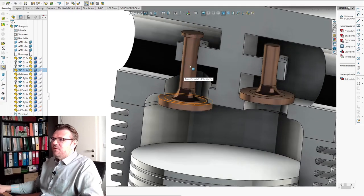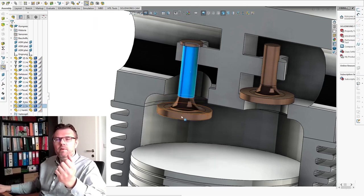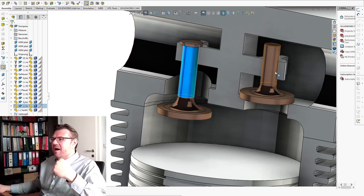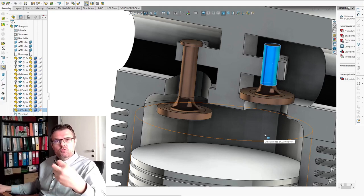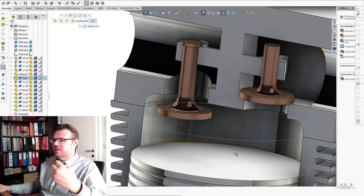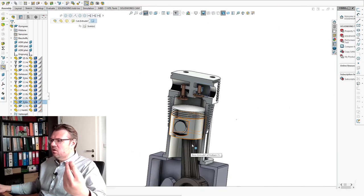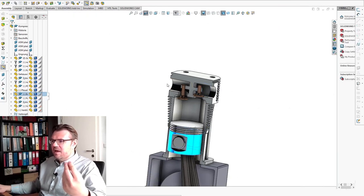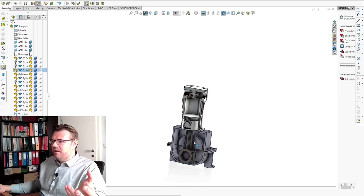this valve, there is usually also a spring, spring loaded, so this valve will open. And this valve here will automatically close, because the pressure inside the cylinder is lower than here. And if the piston is going further down, we simply suck in air from this side, from the suction side. Usually on this side there is also a filter. And then we reach the lowest point, and then we're moving up.